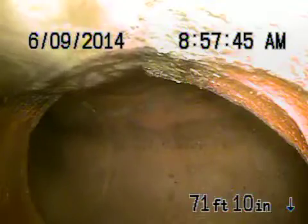Let's bring the camera back. You can see there's your connection to the city — this is a 6-inch clay pipe. Looks like the city put in a new Y because you can see we go to the existing clay pipe. This is a newer pipe and then we go to the older pipe. As we continue coming back, you're going to see heavy roots in the original clay pipe. These roots can be cleaned out but they will return, and they're very thick. You can see it's completely packing the line — basically the whole 6-inch pipe is infested with roots.